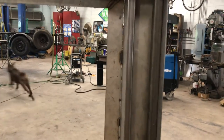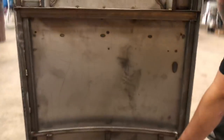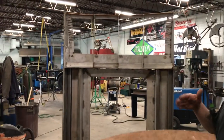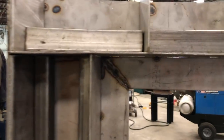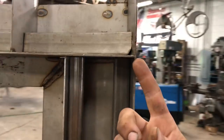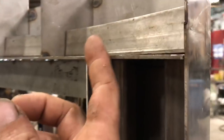I'll get my template here. The template follows everything from the bottom. We had one here, a crossmember here, and then another one up here, and that stiffens the door. What we're going to have to do — you can see on the edge here — is that we have about a 3/8-inch piece of overhang. We're going to have to trim 3/8 inch off all that whole edge before we put our inside piece on.